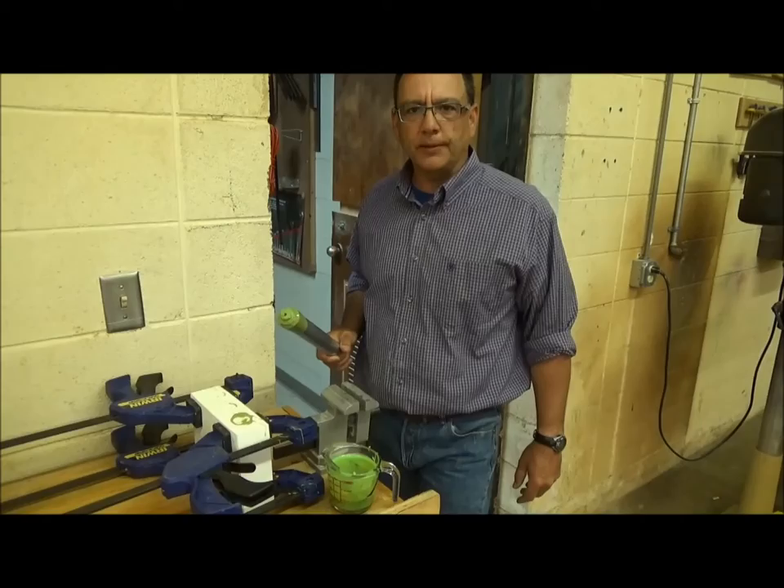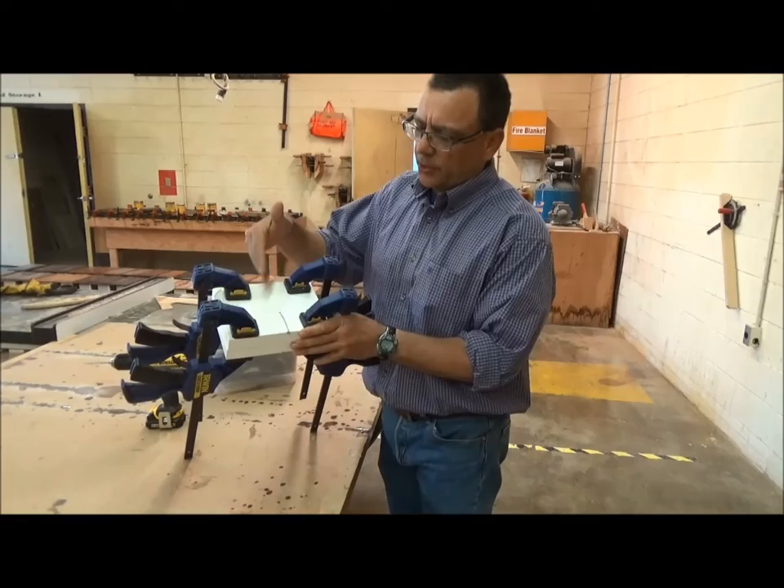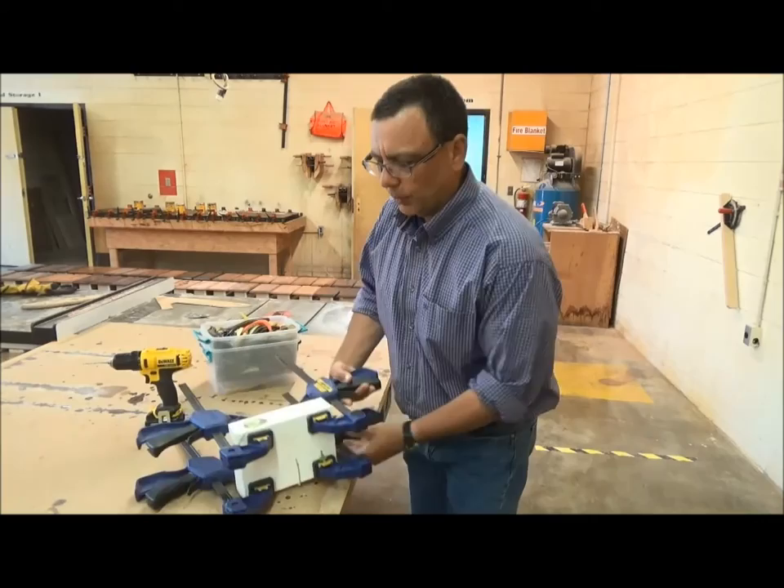We'll have to let this cool about five minutes before we pull the molds apart. On this mold block, I modified it a little bit — I drilled holes in the ends of the tail so that when I make that shot, it goes all the way through the cavity and then ejects out the tail, and that's how I know it's full. I made a couple of shots and was having trouble with the cavity completely filling, so I'll go ahead and open the mold now and we'll see how it works.